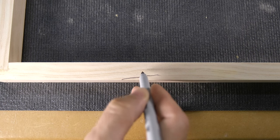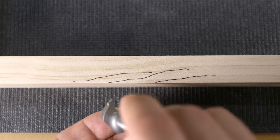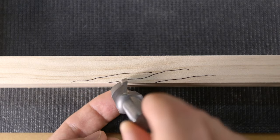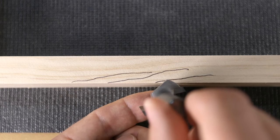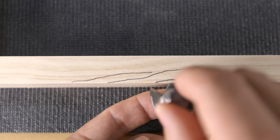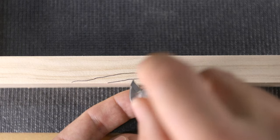If we look back at our frame, you can see that the grain on this board is running in this direction. If we introduce a spinning bit and a counterclockwise feed direction, the bit has a potential to lift the grain or pull it out, creating tear out or worse, chipping. But if we feed in the direction of a climb cut, the bit now actually compresses the wood fibers inward, creating a better chance for a cleaner cut. And now you know why some people prefer the climb cut over the push cut.